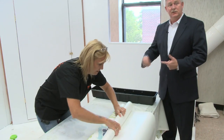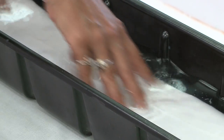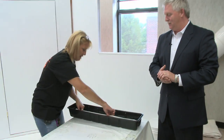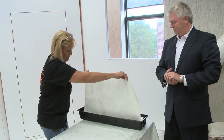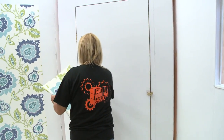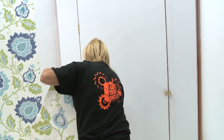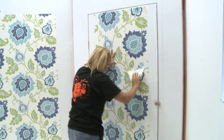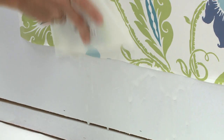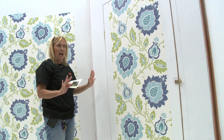She's going to re-roll this so that the paste side is actually on the outside — that's what the instructions call for. About 15 seconds in, okay that's 30 seconds, so we're especially looking for the amount of adhesive activated on the back of the sheet. It's all dripping on the floor here, just oozing right out — that would be all over your baseboards and into your carpet.